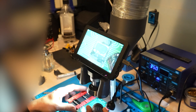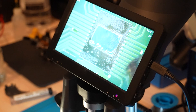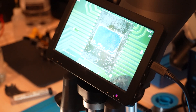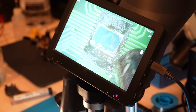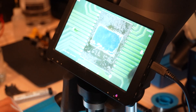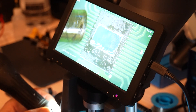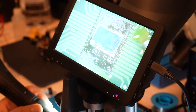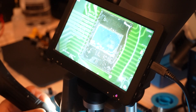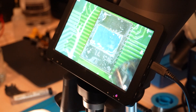You can see it's beginning to change color now — and you see some of them are beginning to look like solid solder. Everything is getting smaller, pulling in from the sides, and the other side begins to change too. Then just move the gun to the other side to finish the job. It's going really fast now because the board is warm. I added a little bit of flux — if anything is shorted, the flux will help the tin move to the pin and prevent shorts.